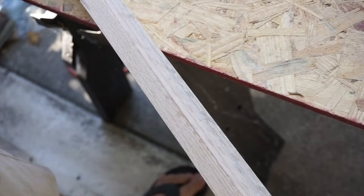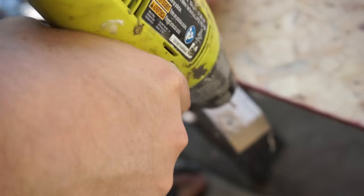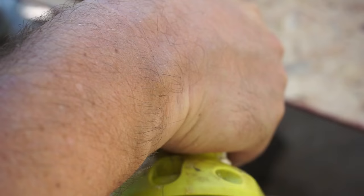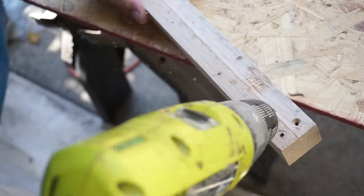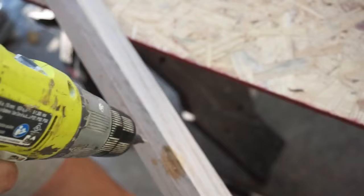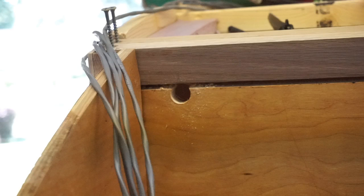You can use other woods depending on what's available in your area. This here is me pre-drilling the holes for each of the screws — I use two-inch screws in each of the ends of the spars. I pre-drilled and countersunk those because they need to be flush, since in the next step you'll be putting the skin over the top of these areas.